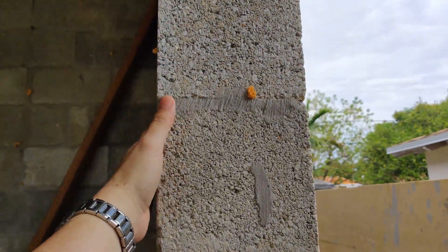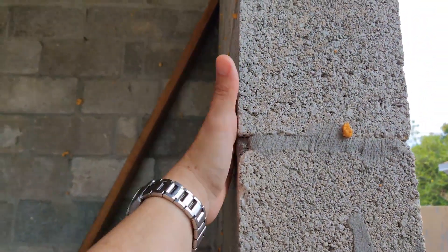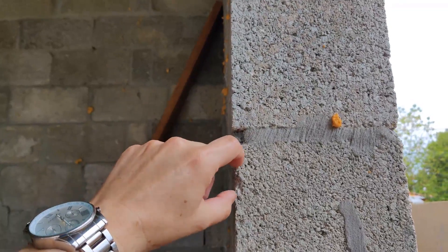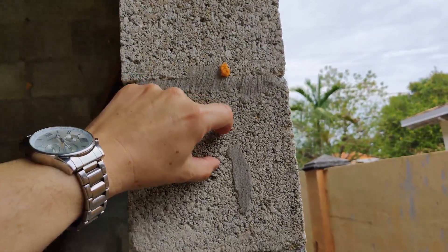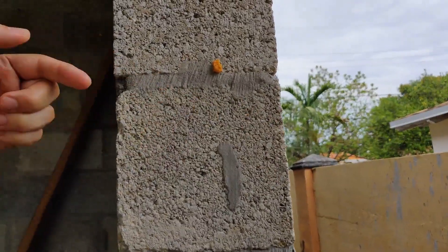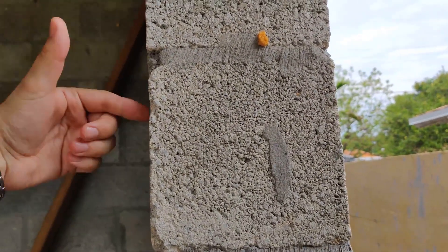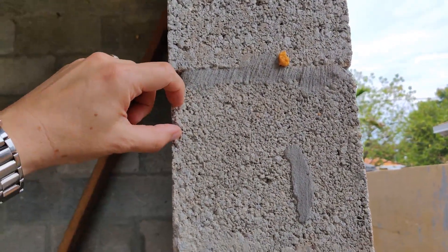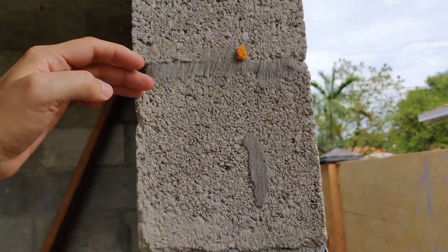If this were the inside wall and this is your outside wall, when you run your refrigerant lines and your drain line — the one draining water to the outside — you want it to go at a slight angle. So as you're drilling, whether you're using a masonry bit in this case or a regular drill bit, make sure you go at a slight angle.